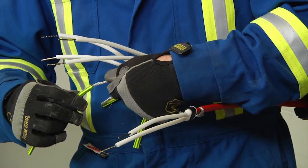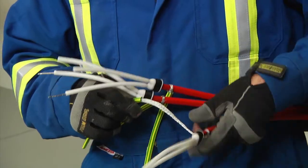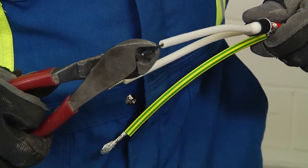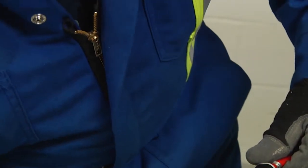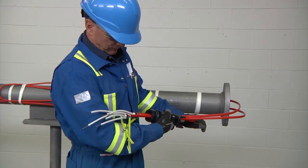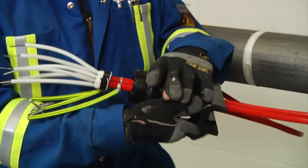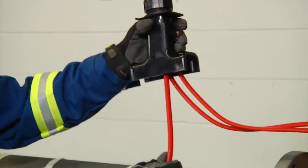Slip green-yellow tubes onto the braids. If needed, trim bus wires and braid, leaving one-half inch (13 millimeters) protruding out. Pull the heating cable back into the stand so that one inch (25 millimeters) is exposed.